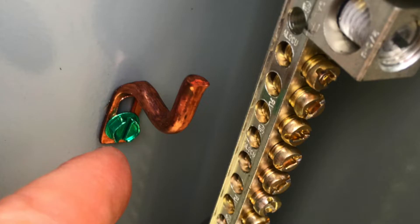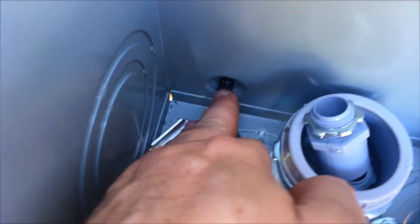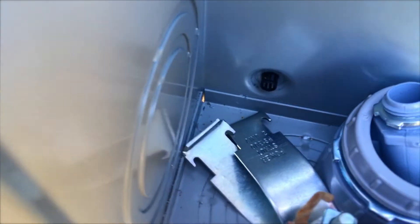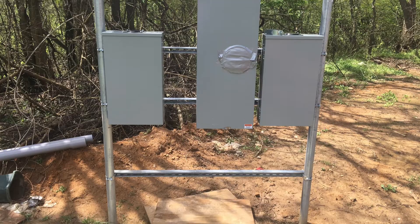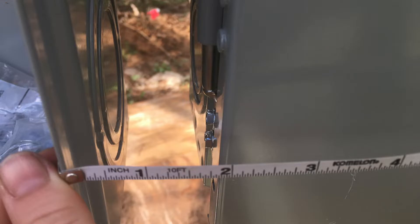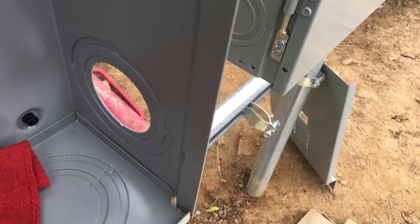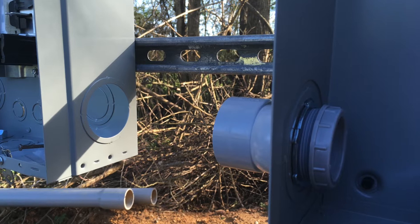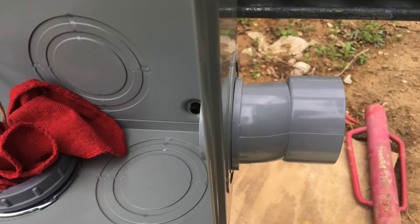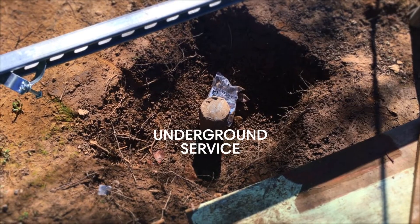There's a little hole in the back of the other 200-amp panel that I've plugged with plastic hole plugs purchased off Amazon — they fit perfectly. Once we have all three panels roughly placed in position, we can slide them around as needed. There's a knockout on this 200-amp panel, and I'll connect that via a conduit chase between the two.